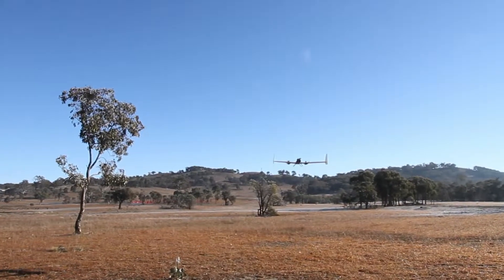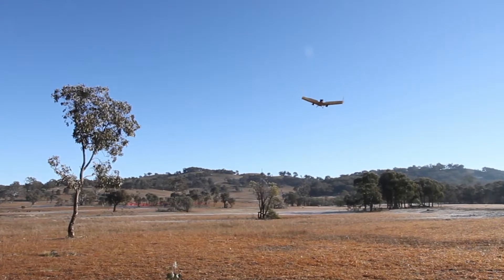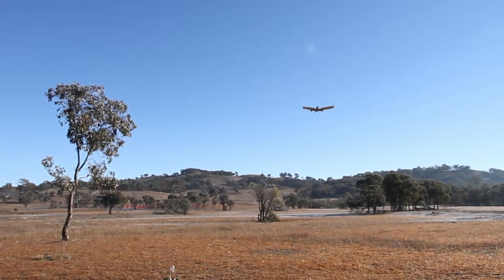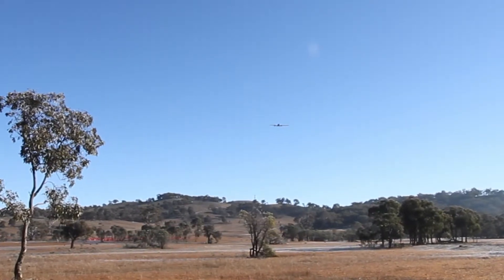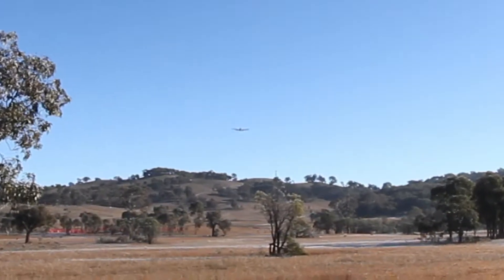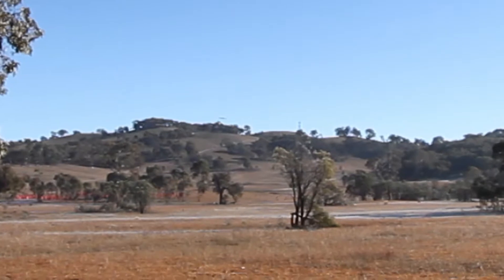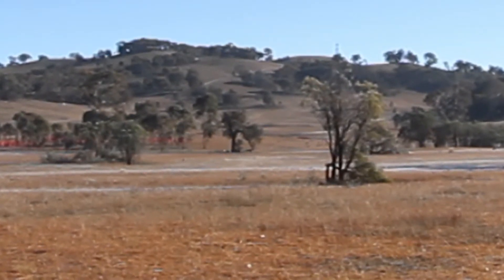The wing is in Q-Hover mode at the moment and I've been flying it over the past few days and it was really quite nice and stable. I'm just playing with the roll controls there. My plan here was just to flick it into fly-by-wire mode and flip back to Q-Hover if things didn't go well, but when I was in fly-by-wire mode I discovered that I had absolutely no elevator control and ended up trying to flip back to manual mode and then went into the ground.